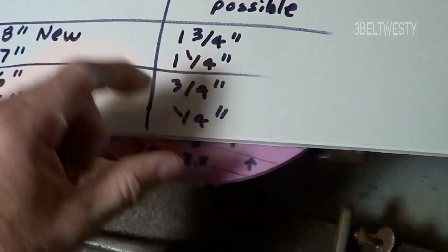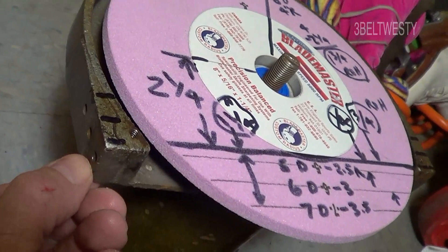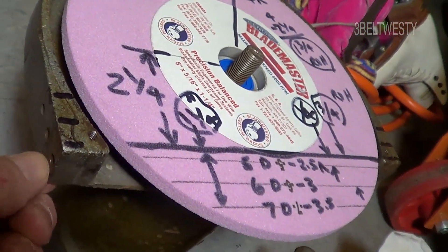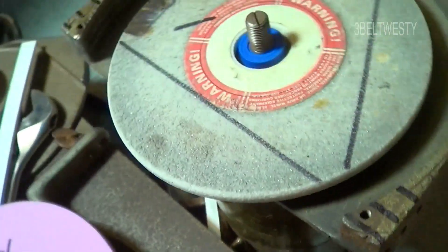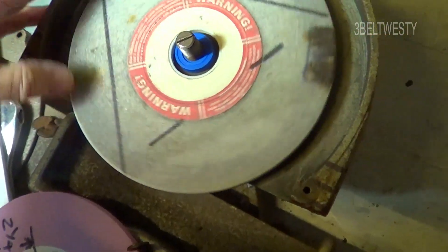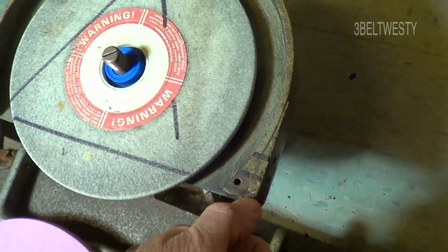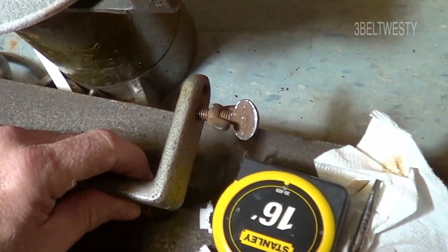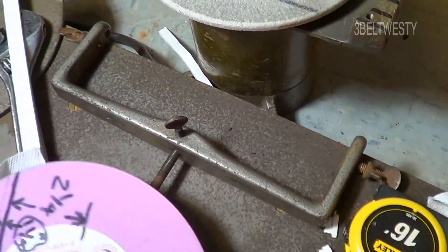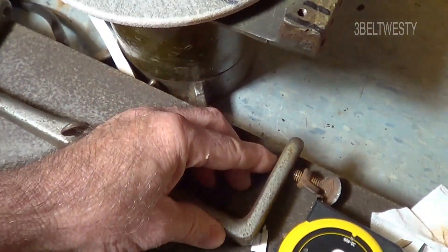This is all because the pivot points are right here. There are four different holes — three different holes on this side and three on this side. If you look where those lines project out, those holes line up here. That's the pivot point. The diamond holder is adjustable, but the radius of curvature is only from these pivots to where the diamond is.